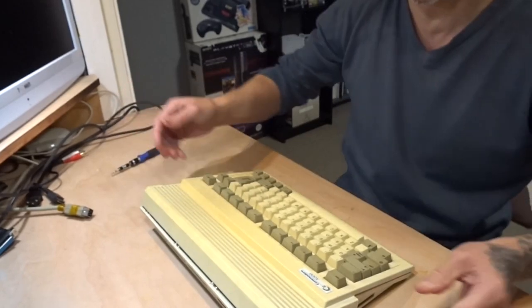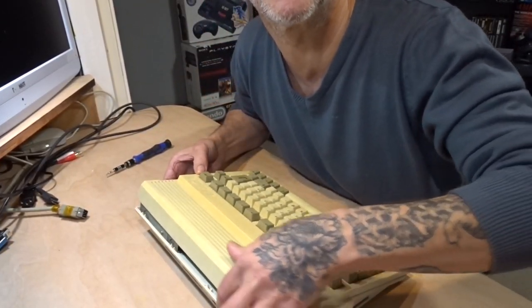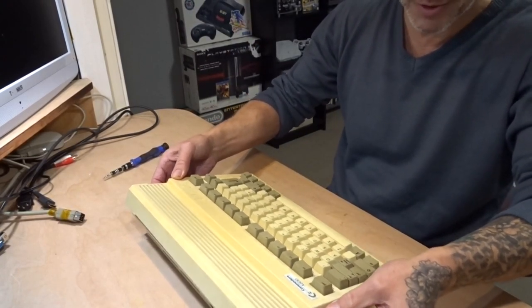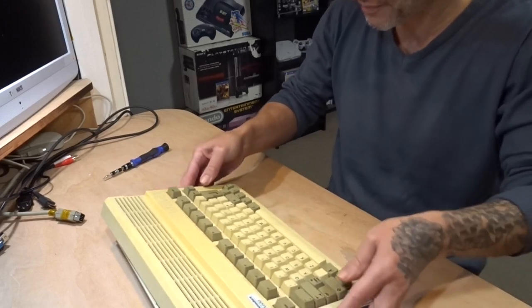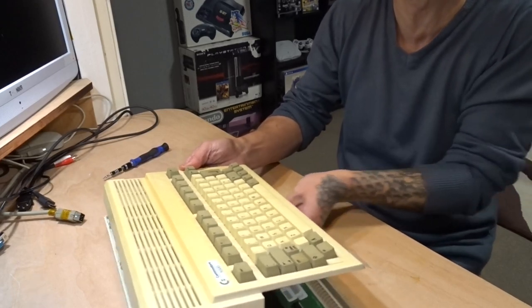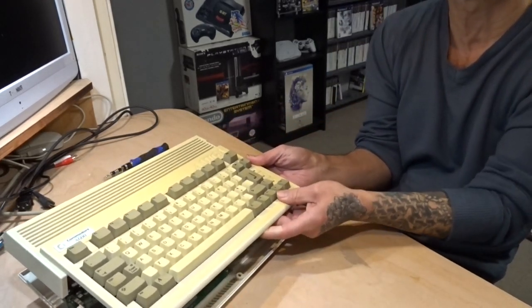Different screw. Wonder how many of these prongs are left in there. Oh, there'll be no catchment prongs on it. So all the prongs on the back are all snapped off. There isn't any. So somebody's opened this, doesn't know how to open them, and there's no shield in it. So when you open these 600s, be careful, don't just yank it.